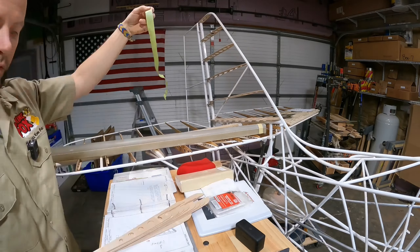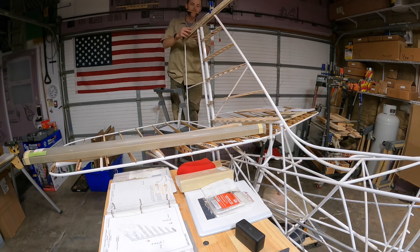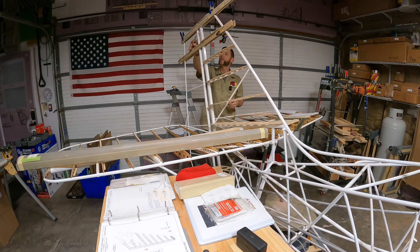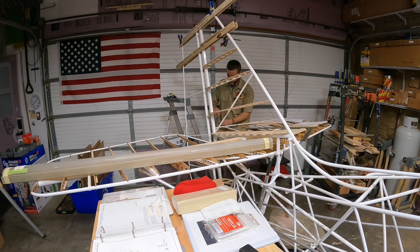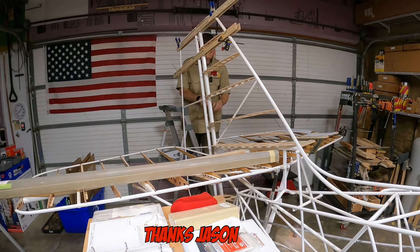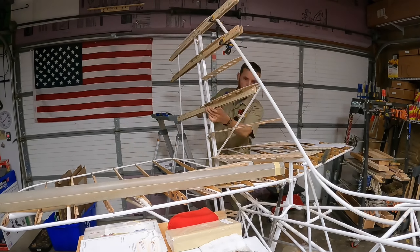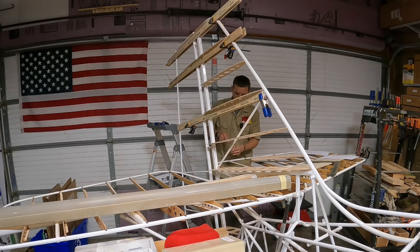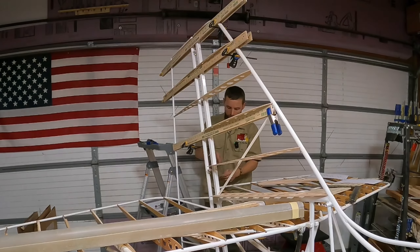Now as we get into the rudder, I'm going to unpack the ribs, peel the tape off, get them all separated, then transfer the lines from the vertical stabilizer straight back to the rudder. I'm going to use these rulers to parallel them underneath the ribs already in place and transfer those lines to the rudder, setting those ribs right on top of those clamped-together yardsticks. Jason Murphy told me about the yardsticks — thanks Jason, I saw him using them on his wing build. I'll probably carry this step over to the wing build as well since I have about 40 of these yardsticks. I'll work my way down from A, B, C, D, and so on all the way to the bottom.